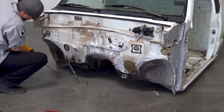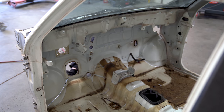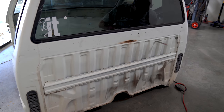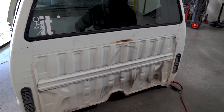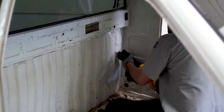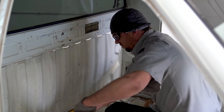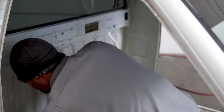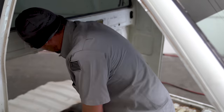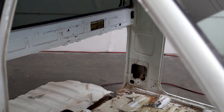So something like the Mighty Max, as I mentioned earlier, most of the structure is in the actual external sections of the body. I typically go around chasing all of the pinch welds. Anytime I see a place where the structure meets a piece of sheet metal perpendicular to that section, that's the closest I want to get to the structural side of it. I can get as close as I want with the saw, but I've got to be very careful when I'm actually slicing it out, because if I cut into the actual structural section, I may get layers and layers deep and might not be able to put it back together, which could compromise things.